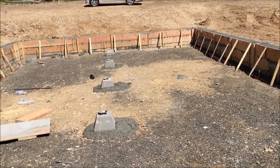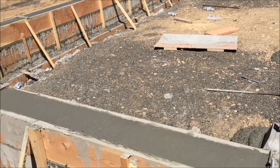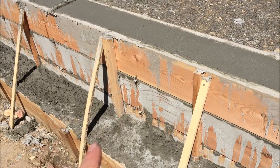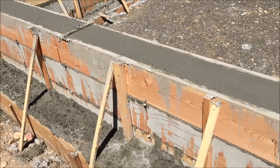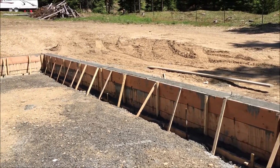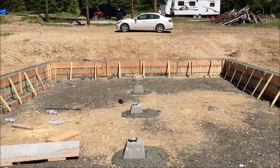I think it came out really, really well. I'm going to use all these two by tens for the floor joists. I put a two by six down at the bottom here, just in case any one didn't come out — I'd rather scab a two by six. Lumber is expensive nowadays, but thank God I got a brother that owns a lumber store — Jacob's Lumber.